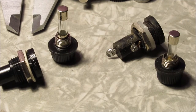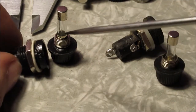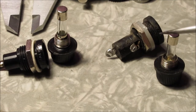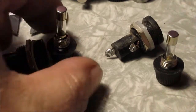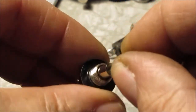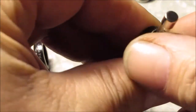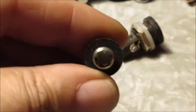Okay, bear with me - this is worth mentioning. You look at these fuses and you'd swear they're the same size. I'll put in the description the sizes. I don't have the package from Radio Shack, but these are at least a little smaller in diameter than these - same length though. Here's the thing: see that nice clip in there? That clips the fuse in. Now look at this old one - that could be the problem I was having blowing fuses. See that? It's all wallered out - if it had a clip feature, it's all shot.